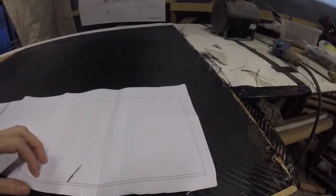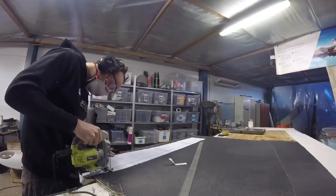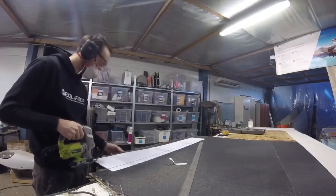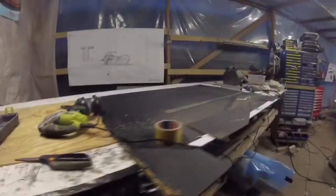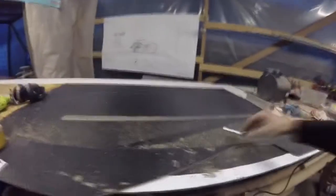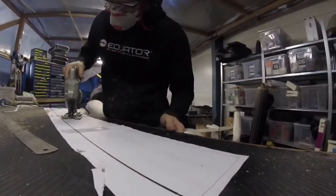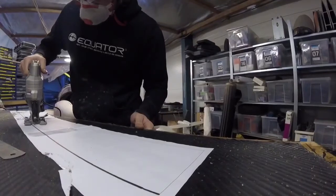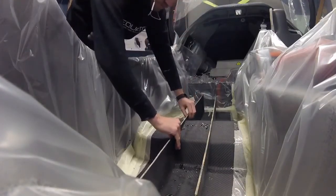We decided to make a rigid box and fixate the batteries to the belt fixtures in the passenger seat. Here we're cutting out templates for the base of the battery pack itself — it was quite a quick process, but it's never fun to make such a radical change this late when we were hoping to have the aircraft at the airport for taxi testing. After calculating it more carefully, we figured this is the right way to go.